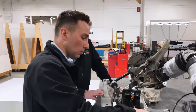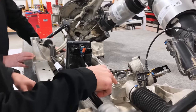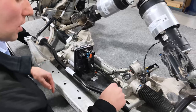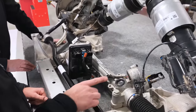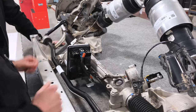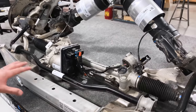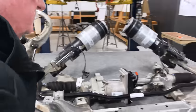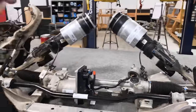What did change from the last Model S to this one is the bolt installation axis. Right now these are top-down — a Z-axis installation. On the last generation they put those bolts fore-aft in the X direction. What that gives you is additional packaging space. We've got a beefy motor up here with a lot of thermal management, so they're getting whatever they can on this module to sit down into the assembly better.